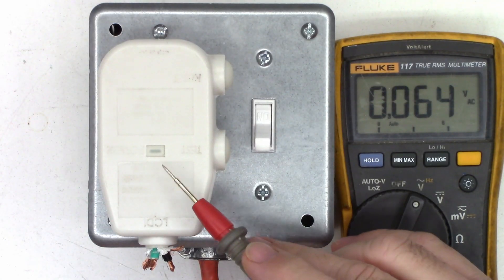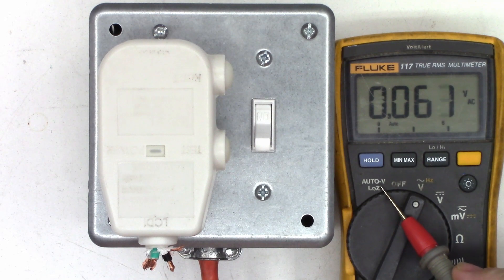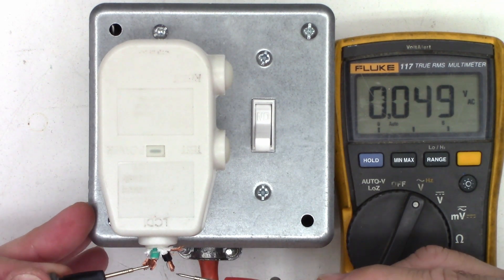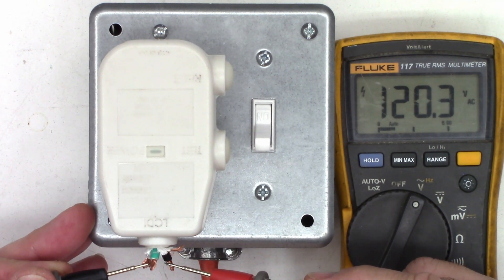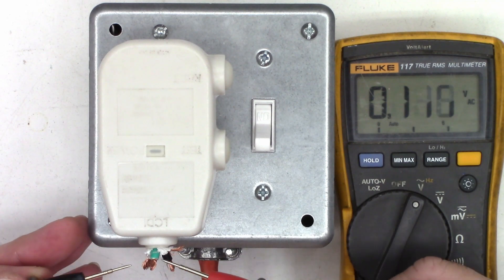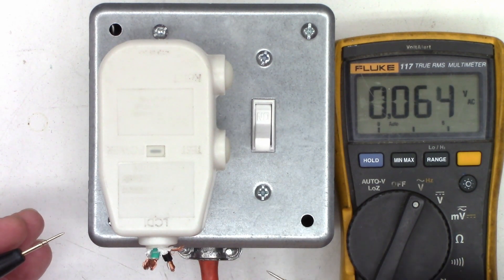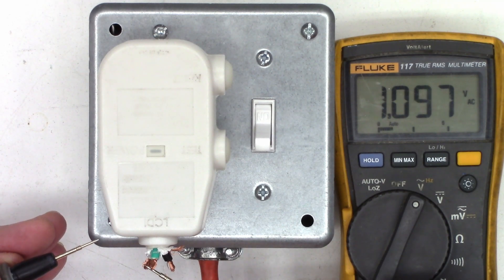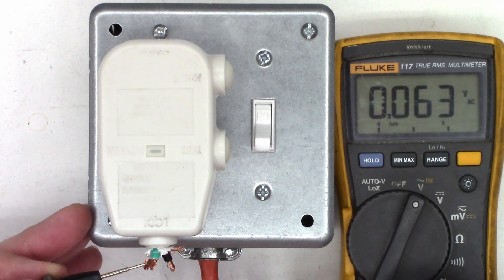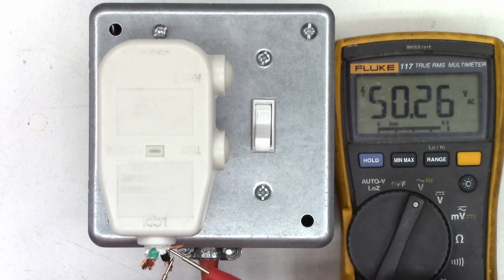The power's on right now — it's hard to see, but the light is illuminated. I'm on my AC volt range, the high impedance range of the Fluke 117. This is the low impedance input, and I'm going to use that in a moment to trip this device. If I measure between the hot and the neutral right now, I see 120 volts. If I measure between the neutral and the earth, I see 3 tenths of a volt, because the earth does not carry any load. The neutral carries the return load back to the breaker box, and theoretically the earth and neutral should be bonded at the breaker box. Let's check between the neutral lead and the shield — about 48.5 volts. Between hot and the shield, I see about 50 volts.